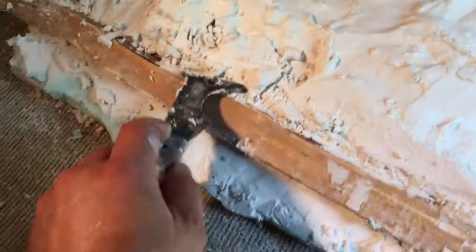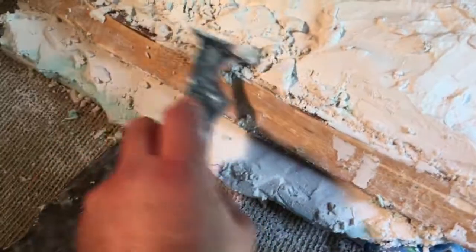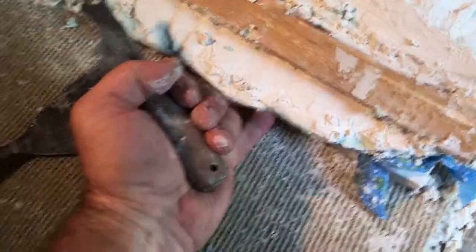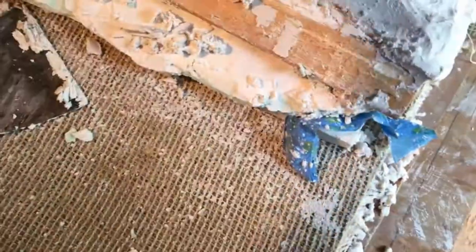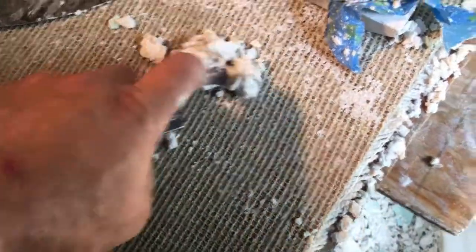But this is set up pretty perfect. I ran this a little weak. It's still wet and crumbly, so it carves off without a lot of stress. You don't want to dig into it and pry big pieces, because that stress will break your positive. You want to just carve things away and relieve them, maybe cut down, but work these away without stressing the positive, because that positive isn't cured yet either, and you want it to be a little bit moist just in case you've got to slip something to put it back on.